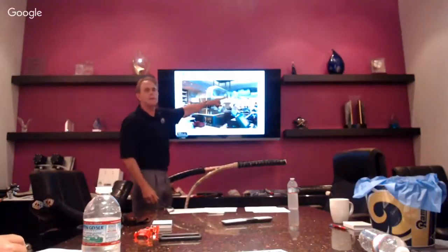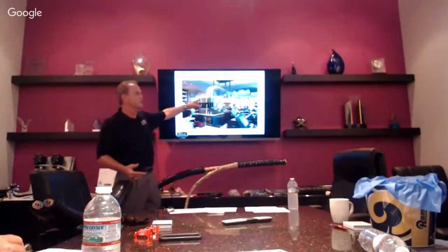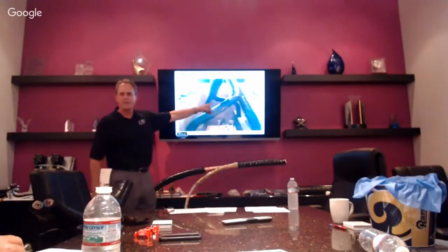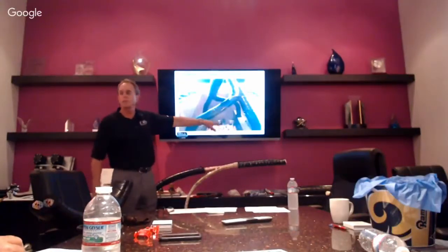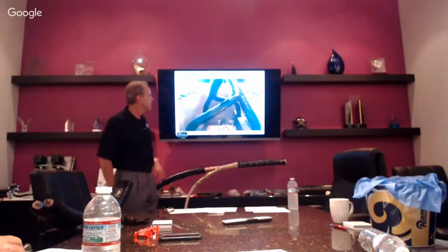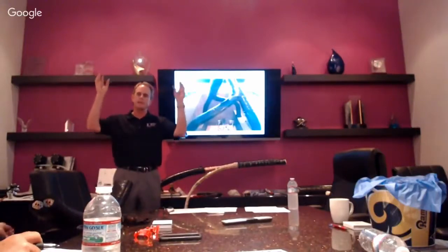So this is, you see these at different places, Yard House, a lot of the brew houses. And I don't know if you guys have looked up inside these boxes and wondered what the beer guys do up in there. That's what they do. They come down with the main line and they split them. Again, we don't tee them, but we split them. And that's what you see once you get up there. They go down into each section because those big brew pipes have 2 legs, so they each have leader lines coming in and out.